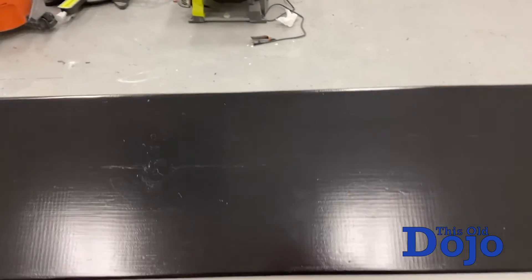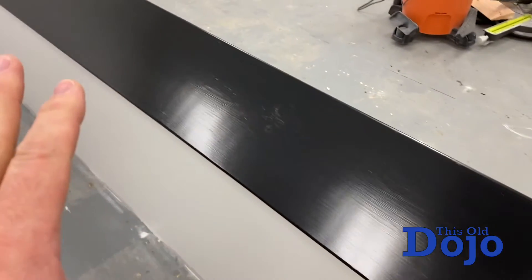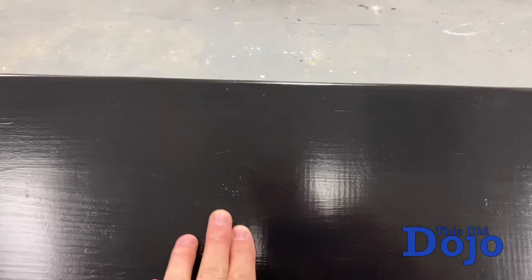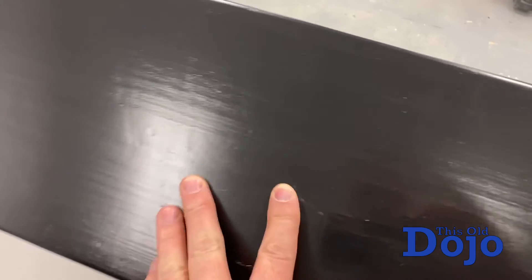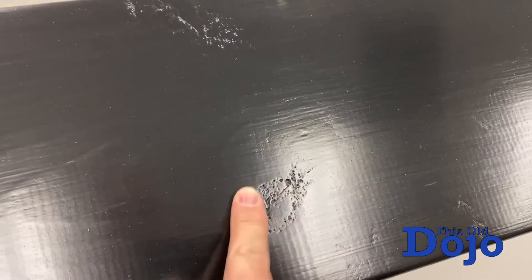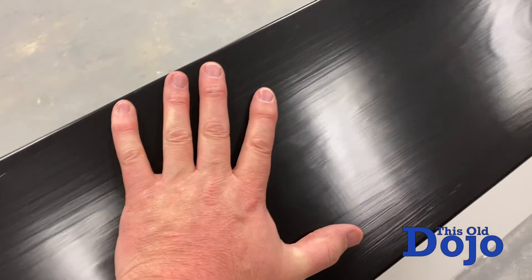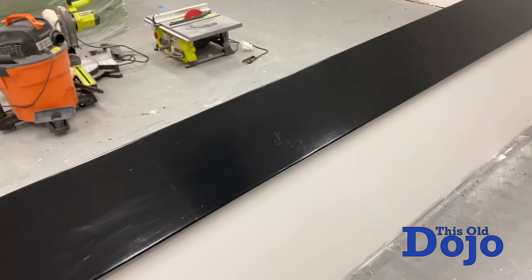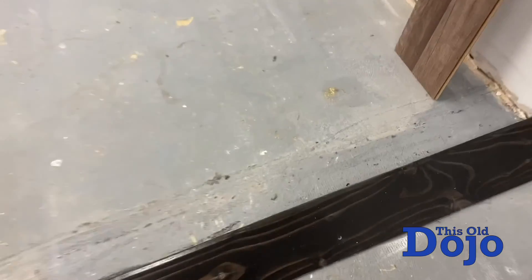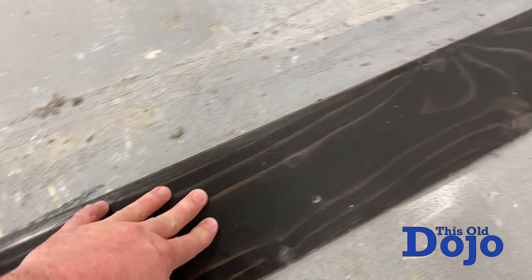So you can see here — I used a semi-gloss, and you can see some of the wood grain. Like I said, I stained this black, but it is so black that it actually looks like I painted it. You can kind of tell where it didn't take in some spots. Where it comes down to the knots, it's a little off-colored — you can see the brown in there. But this is smooth, so smooth and so shiny. It looks great, even though it kind of looks painted. Down here, this only has three layers of lacquer on it, but also stained black — you can actually tell the wood grain a little bit better.